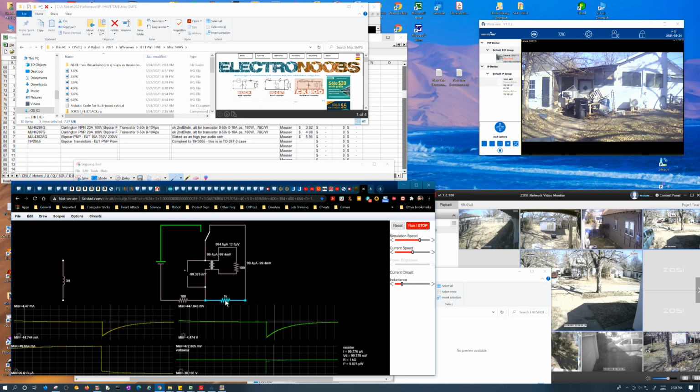So it's hard to say a cause and effect, because this has the appearance like, oh, this knows somehow it was charged with 100 ohm impedance. It doesn't really know it was charged with 100 ohm impedance. It just knows it has a certain amount of current into it, which results from it being charged with 100 ohm impedance. But I could have charged it with a different voltage, too, and you'd have the same result if it had the same amount of energy in it. So that's what I'm trying to say: don't get confused over this versus this ratio. This only applies for this situation, given the voltage it's generating.